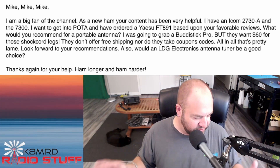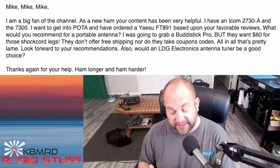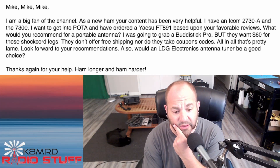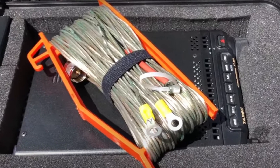Here's something I put a lot of thought into — it's very easy to just go out and buy an antenna, which is not what I did. What I would love to see more people do is actually build an antenna. I built at least three, maybe four antennas before I ever bought a commercial one. I made a 20-40 fan dipole for home, and when I was still a technician I made a six- or ten-meter dipole. Once I fell in love with portable radio, I made a KG6HQD speaker wire antenna for 20 meters and it worked fantastic. I'll put links in the description for that video.